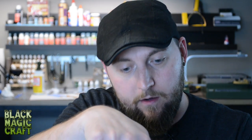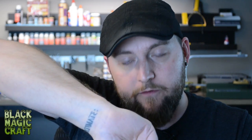Every carpenter worth his salt knows that the number two most important thing to making a safe cut is being 100% in control of your tool. It is very dangerous to not be totally in control of what your tool is doing and how it's interacting with the material. When you're cutting towards yourself, this is the way you have the most control because ergonomically it makes the most sense. You can see the part of the piece you're cutting in front of the blade, and your blade comes towards you so you can prejudge any micro adjustments. When you're cutting away from yourself, you don't see what you're cutting — your eyes are following the cut instead of predicting the cut.